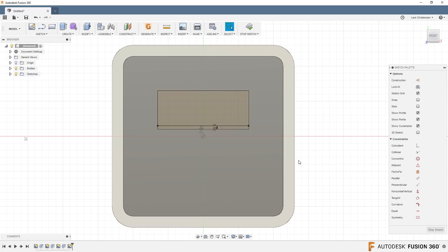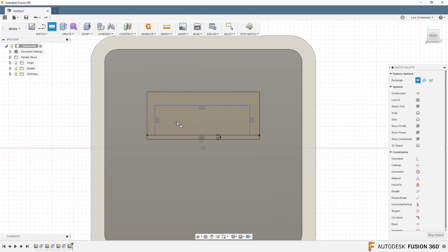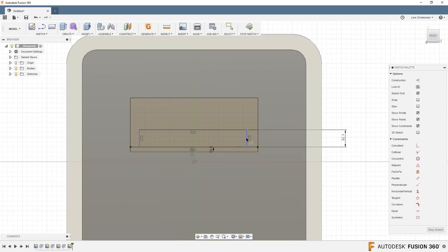I really only want this one line, then I'll do another two-point rectangle sketched on that line. D for dimension — the width is going to be 1.75 millimeters. For the offset from the edge I'll make it 0.5. Now, did you know you can double-click the second dimension instead of typing a value, then click the first dimension? It gets an fx value, meaning it follows the first dimension. So if I change that to 1, the other follows. Just another little trick.